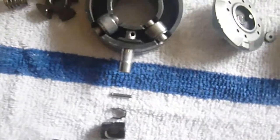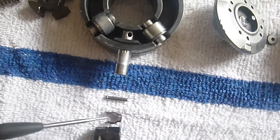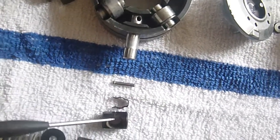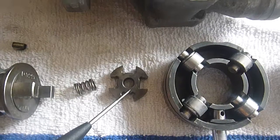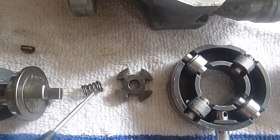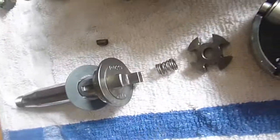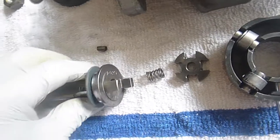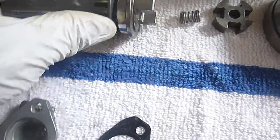Now we're back at the roller assembly. The roller assembly has a small pin that locks it in place, and it has a clip that goes over that and goes down into the silver assembly. Then we have our X gear. You have to make sure that you put these things back in proper alignment. Between the X gear there's a spring — the spring actually goes down into a well inside of your main shaft. And there's a washer.